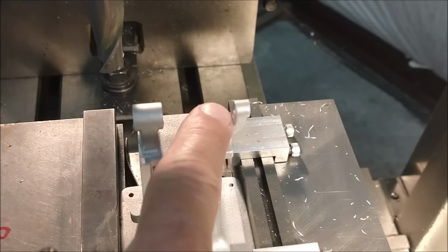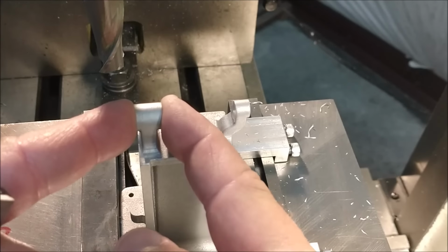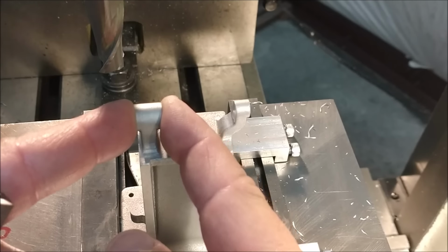After gathering up all the numbers, I need about an 8/1000 cutoff of here, and then a symmetrical removal on either side of this should bring everything in nice and smooth. So that's next.